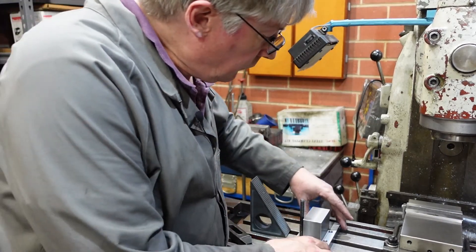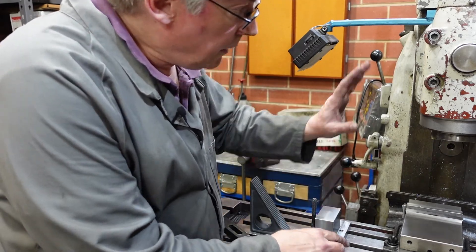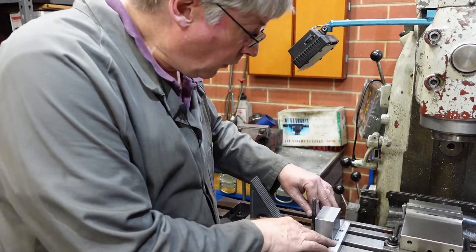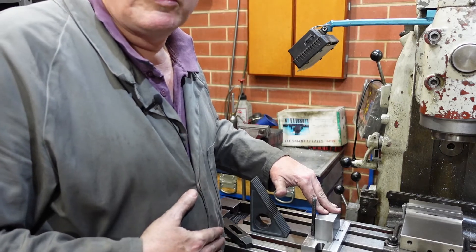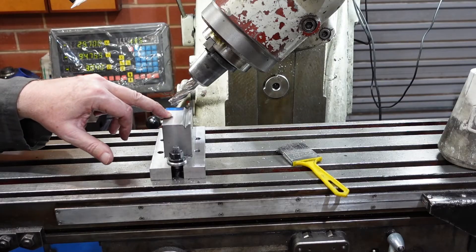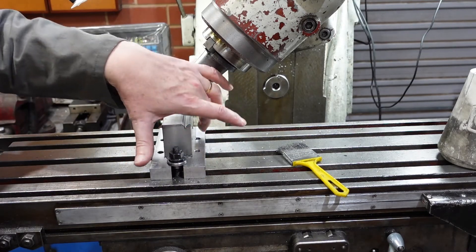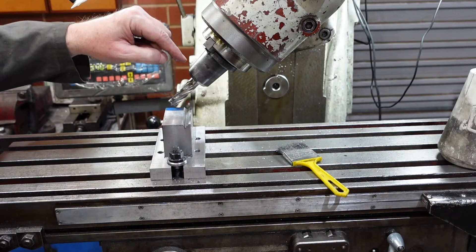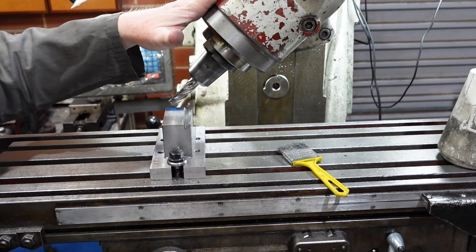The other thing to note is that because I made a decision to make that the same width — so I could set it across the table — I can tilt my head over and use that to cut my V-grooves, and that was one of the reasons I thought it'd be nice to do that. If you made it shorter you could just hold it down with hold-down clamps, but part of good design is not just 'does it do what I want' — which this should do quite nicely — but also is it set up so it can be made easily and efficiently. I'm now doing the last steps in making my standoff V-block. This one is for small rod stock and this one is going to be a bit larger. I've trammed it up on that edge so that if I want, I can line it precisely and know that slot is going to be in the right spot.